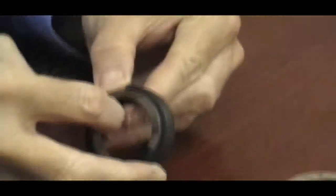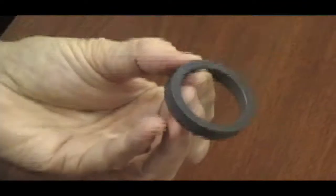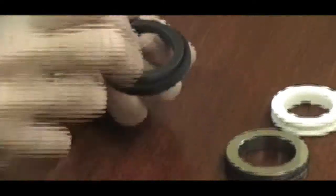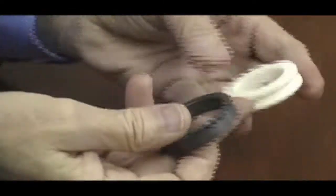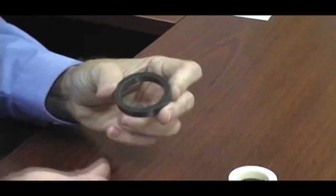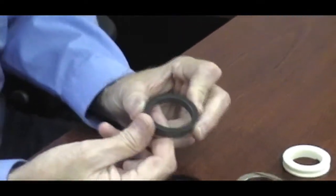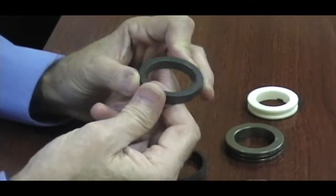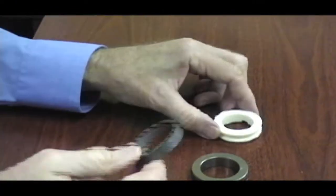Another common material is silicon carbide. You'll see this both in seats and as a rotary face material. It is light like ceramic and weighs about the same. It's extremely hard — as hard as tungsten carbide — and it does not thermal shock, meaning it won't break with a quick change in temperature, which can happen with ceramics.